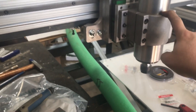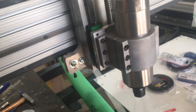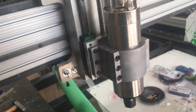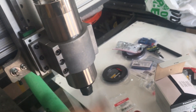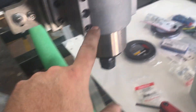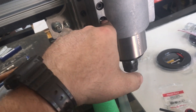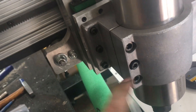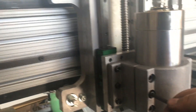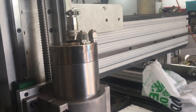Hopefully that helps you guys. The kit comes with pretty much everything you need except for those clamping bolts — I really wish they would include them. If you get a kit that looks like this, these are M8 tapped threads. The center hole is for a jacking bolt, but if you want to use a smaller screw in the middle, an M6 metric screw will fit in there as it's also tapped on the backside for six millimeters. So when you order the kit, grab a couple M8 by 40mm screws, plus whatever size for your mounting screws, and you should be good to go.